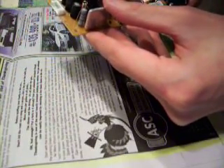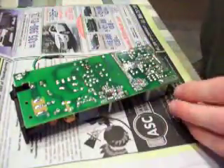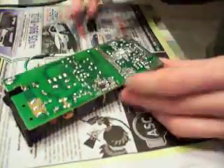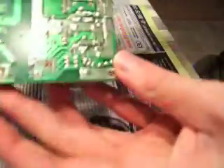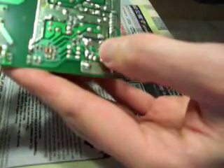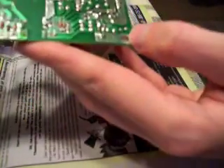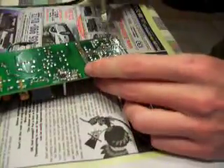I'm actually going to cheap out here and just replace three of them. The rest are inevitably going to fail also in a year or two, but I'll just open the back up and fix it again. You probably can't see this on the camera, but I love it when they do this sort of thing — they have a surface mount resistor glued right under the cap leads here. That's a sign of bad engineering right there.